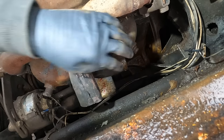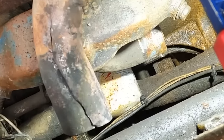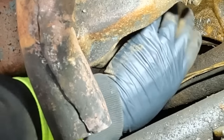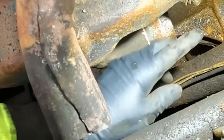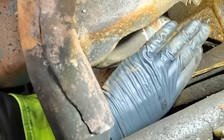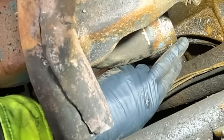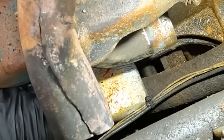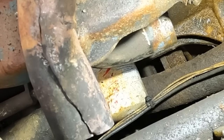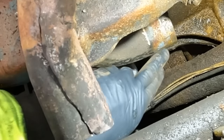And then if you look right here, so I need light in there for you, right there, that's our air intake. And so I removed the, there was a 90 coming up, and a 90 coming out. And so I removed that so water cannot directly get in it. On top of that, the elbow comes straight over at an angle and then it has to come up into this manifold right here, the intake manifold. So that 90 shouldn't collect water.